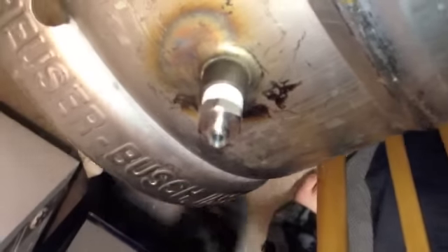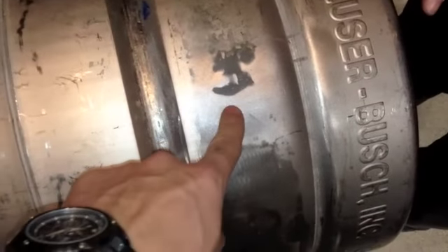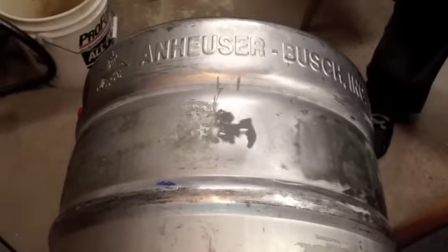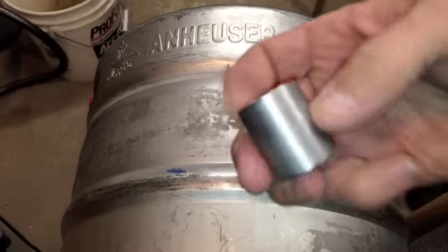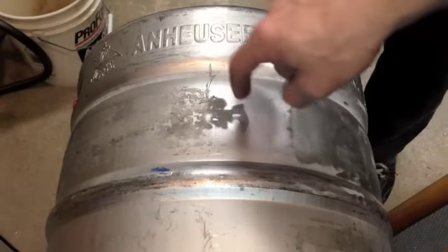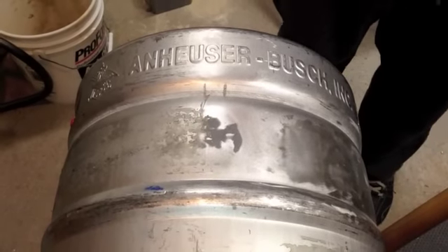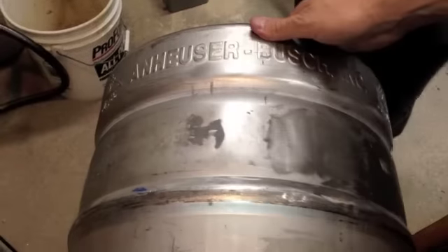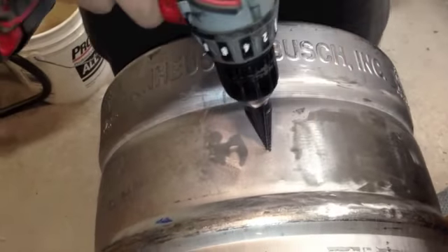Here we've just kind of scuffed it up, sanded it a little bit where we're going to put this in. You can see here we've done one of these already — this holds a thermal well or a thermocouple that goes in the keg. We're going to put another one up here; this is going to be our fill. We're going to hook up the step bit on the cordless drill, then pop a hole. We've gone ahead and hit this with sandpaper — you can see there's no lettering on it anymore, sanded it really, really good. Once we get the hole drilled and dimpled, we're going to sand that really well, apply the flux, and pull it through.